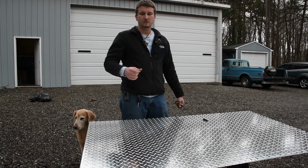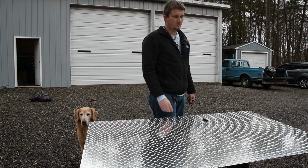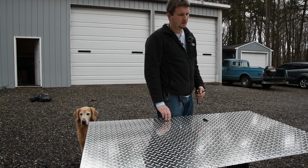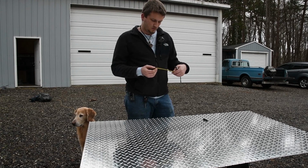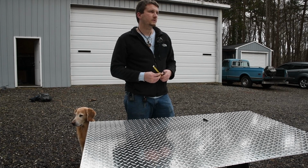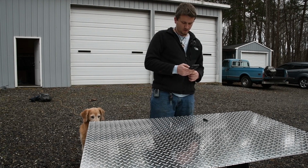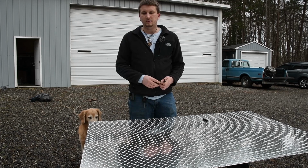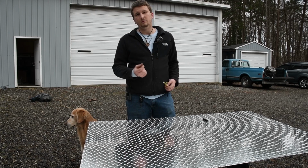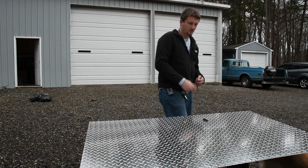So I'm gonna try and measure that out. Do a 2¾-inch drop on the front. Let's see, calculations were 2.82 inches. What's 2.82, a little over 3/4. 41/50 is what that reduces down to. So 7/8 is 0.875. I think that's probably close enough. It'll have a little bit of a lip on the front, but that'll be okay.